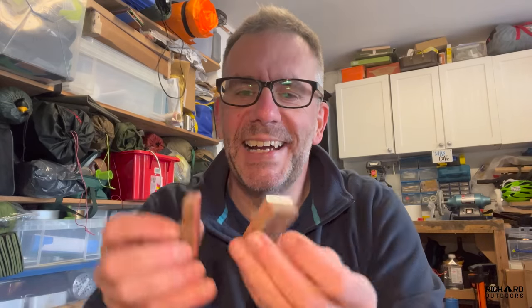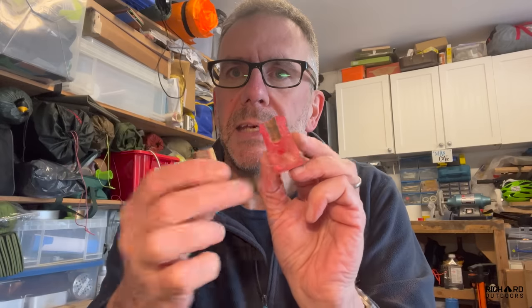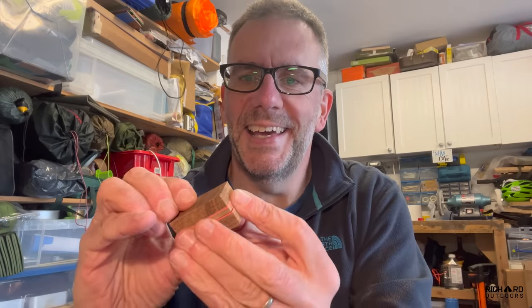There's quite a lot of dust around. I think the heat from the sanding process has melted the epoxy — I obviously hadn't made enough abrasive surfaces for it to stick adequately. So I'm going to drill some little divots in here so the epoxy can get a grip and re-glue that piece. A little bit of a pause in proceedings whilst I re-glue that.